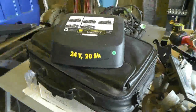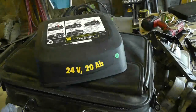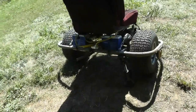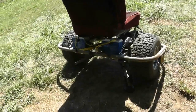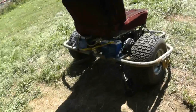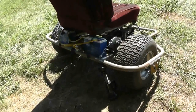Batteries and charger: I used two batteries that were actually part of a lawnmower unit — 24 volts, 20 amp hours. They were about the biggest amp-hour batteries I could get, around $129 for the pair. The charger was about another $40. It takes quite a few hours to recharge the batteries. You could also use cordless drill batteries — cut the handle off an old broken drill, get the right connector, and you've got the charger too, though 20 amp hours is a pretty good capacity.